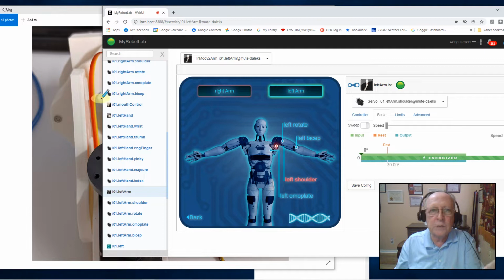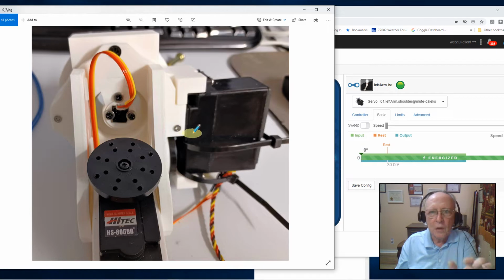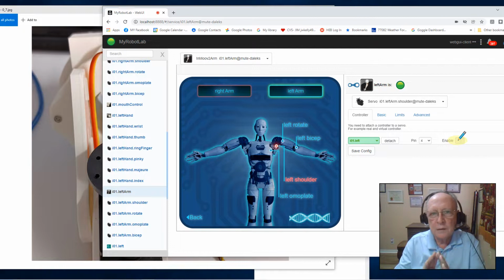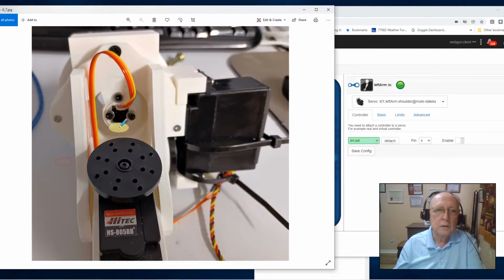Like that, to do that alignment. Once I'm there, then I would stop. I would hold it, of course, and I would disable my servo motor so that it stopped. That way I don't have to worry too much about it. Then I'd go in and I'd tighten down that placement screw. This one right here. That prevents this from moving.